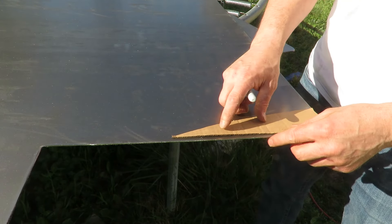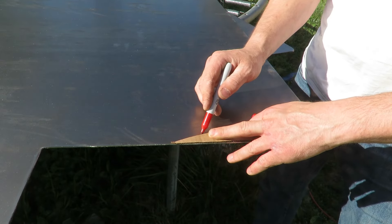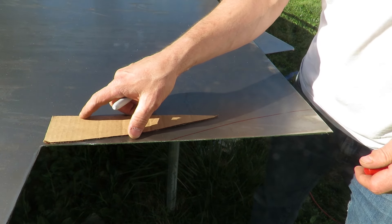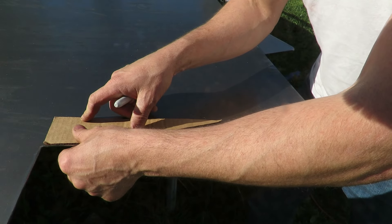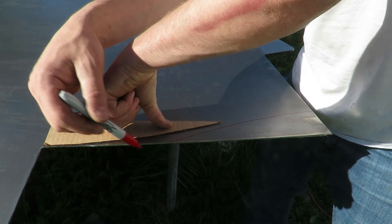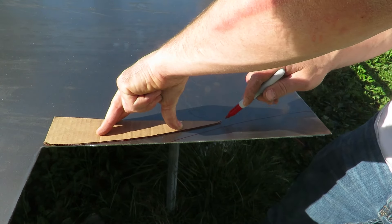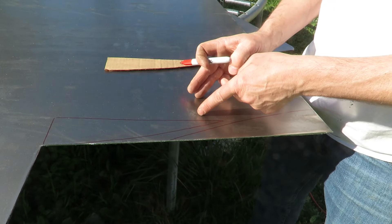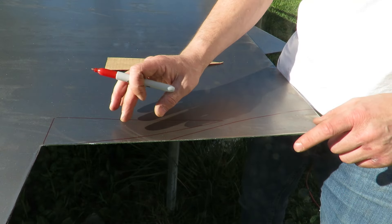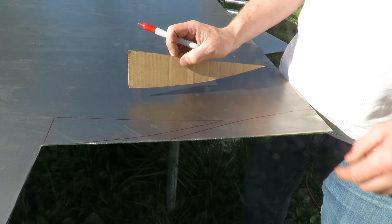I got the sheet metal — got one flat edge right here so I'm just going to line that up. I'll have to cut a flat side and a curved side to it, but that's not a big deal, that's super easy. I'll also have to cut a straight piece right here so that I can weld it in here. I was trying to figure out some way to stamp this out or fold it, but I couldn't think of an easy way — that's why I'm doing three pieces: one, two, and then a straight piece will be three, and then we'll be done.